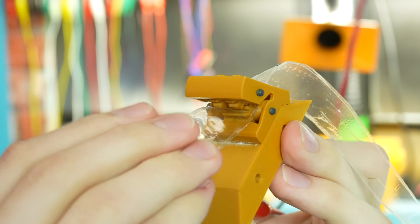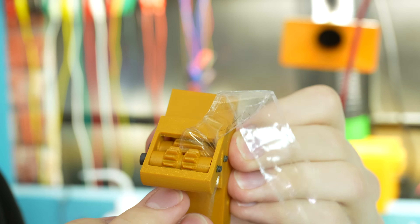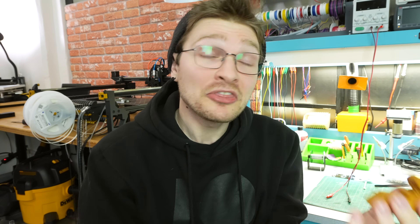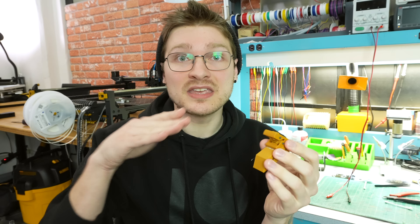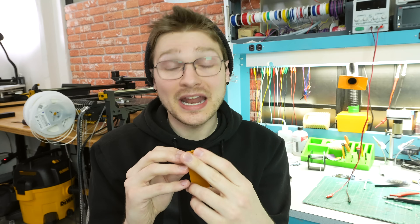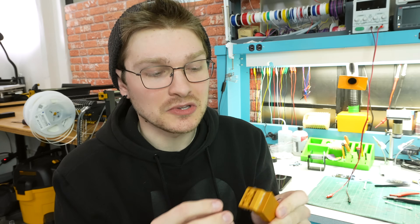It is putting up a fight. Let me see if I can actually get the adhesive section on the gears — it's not sticking. That worked exceptionally well. It had a good amount of grip on the film, definitely enough to peel it off, but also if I pulled really hard on it, it would slip — which is the whole point of this mechanism. Also, the adhesive did not stick to the gears, even when I ran the adhesive section of the film right between them. This is pretty new film pulled off a fresh roll so the adhesive is still strong. I'll still leave the edges open because I don't want to risk it. This is convincing enough — I think this is a valid approach, and now I will bother going through and fleshing out the design.